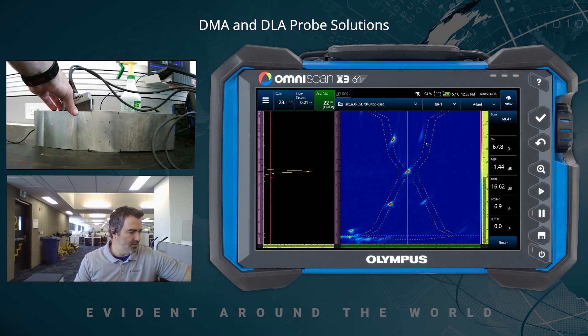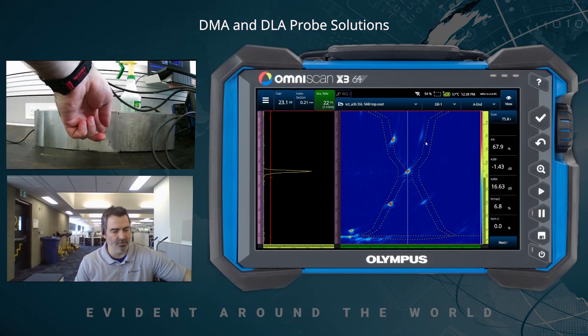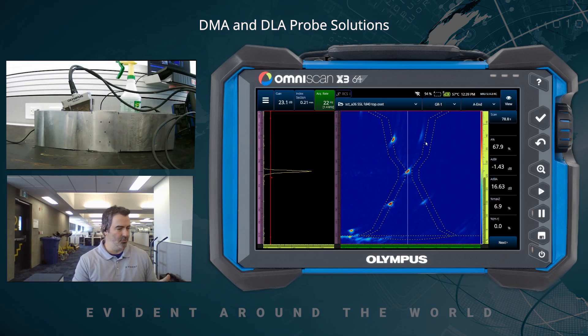As you may have seen, we can also test on the side of the block — just to have a longer sound path and show you the difference. Those wedges are designed for a focus depth of 40 millimeters, but we also have bigger ones designed for a focus depth of 200 millimeters. Through a mechanical wedge roof angle, we can move the natural focus point of the probe.